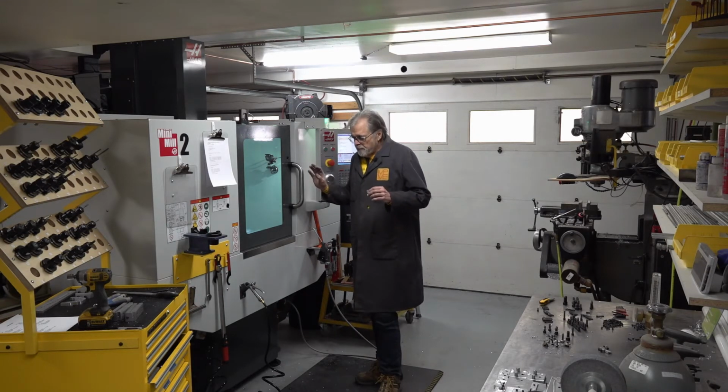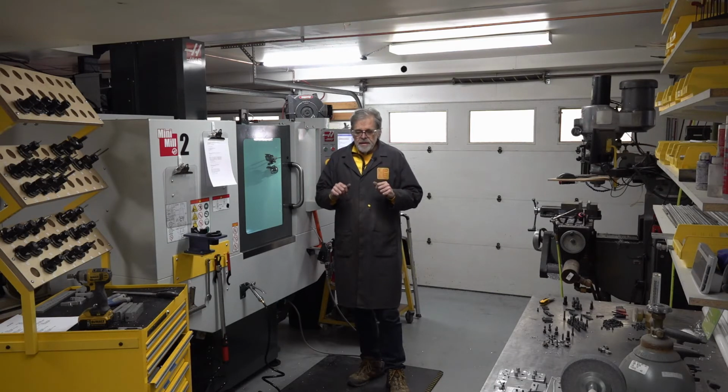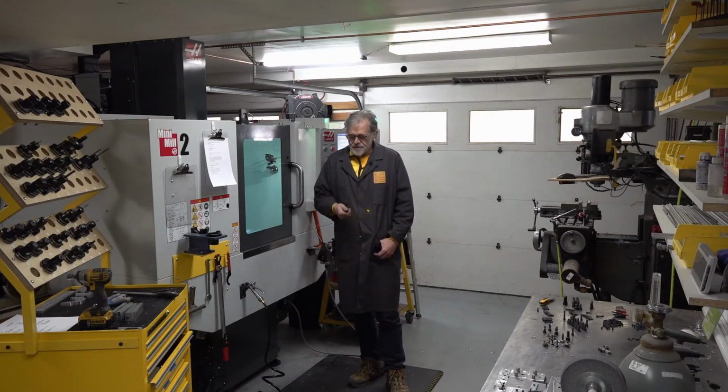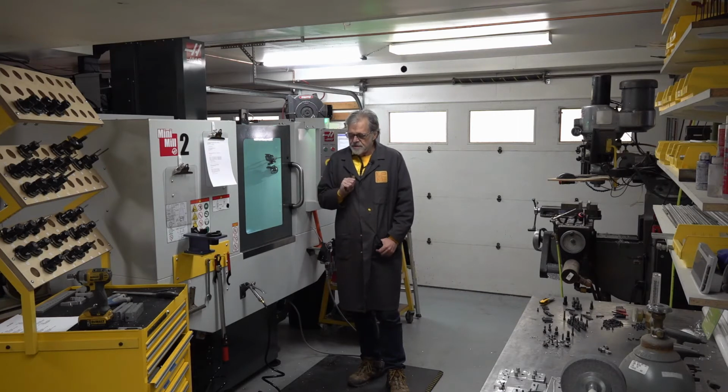So what I'm doing here is actually two things. The 1/4-inch material needs to, let me start over again. This is a bogie that holds the bearings for the clamp mechanism that clamps the glass rod or tube in place. The bogie needs to rotate very freely on its axle, and the axle is a 1/4-inch diameter shoulder screw. A shoulder screw is made pretty accurately, and the aluminum extrusion isn't. If the extrusion is a half thou oversize, and sometimes they're 1 or 2 oversize, and you clamp down the shoulder screw, it binds, and that's no good. So I need to reduce the thickness to get proper clearance so that the axle works really smoothly.